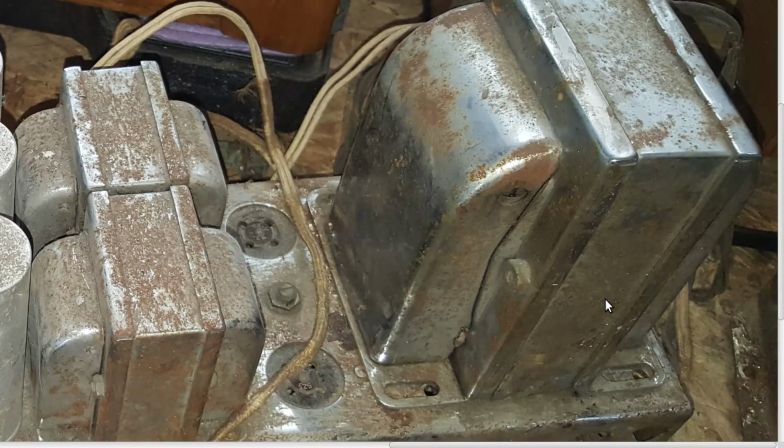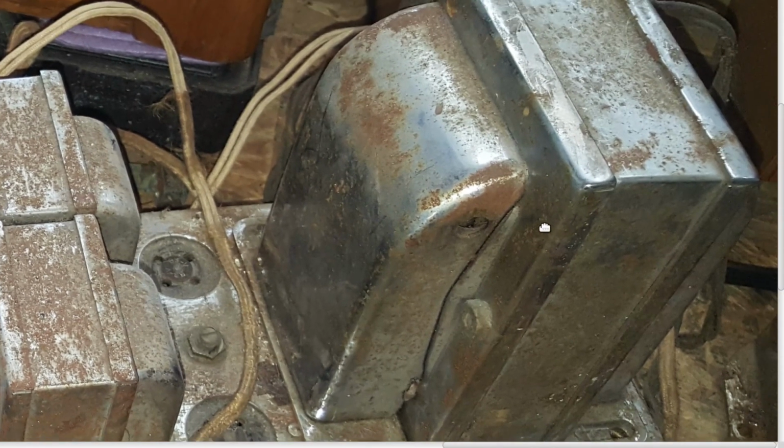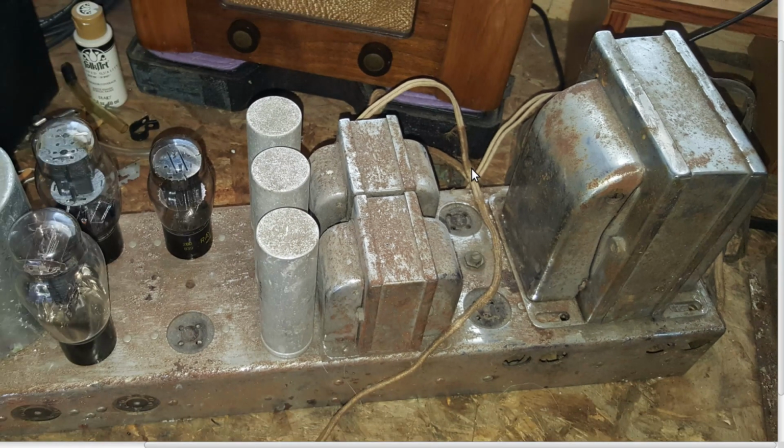Specifically on this power transformer, which handles a lot of power, the windings get hot and the wire gets hard and inflexible, and the insulation loves to get rock hard and crack, in which case all is not lost. You just rewire the transformer, re-terminate the connections to the outside world with modern wire, and use copious amounts of electrical tape, liquid electrical tape. Let's look at the next slide.